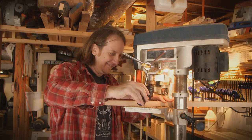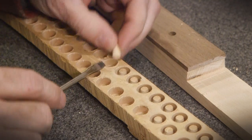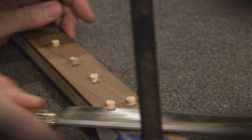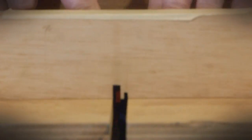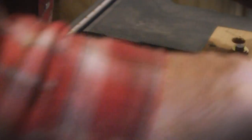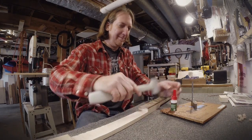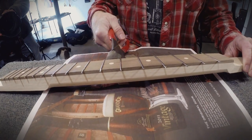I start with the neck. I like to pick up a nice fretboard — like this is a walnut. I cut that out to fit on top, and then I do the inlays on the fretboard. This is a scrap piece of wood, so I try not to throw any of my wood away, I try and keep everything. You just pull that out, and that's a little plug that we're going to fill these little holes with. Let those dry, then I sand that down. And then I'll do the fret markers on my table saw — I have a little jig I kind of made up with another template. Then you've got to sit and hammer frets. Frets come in long sticks. You get on a roll though, you get going and knock out a whole neck before you know it. Next step would be to finish off your frets, sand them all down, file them off.